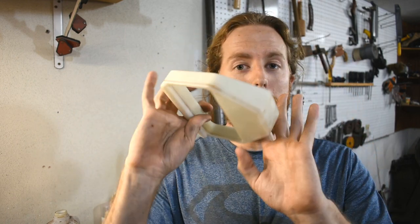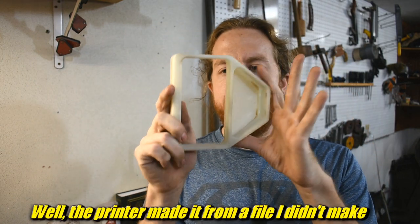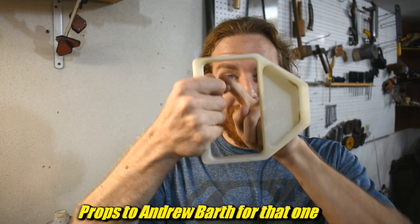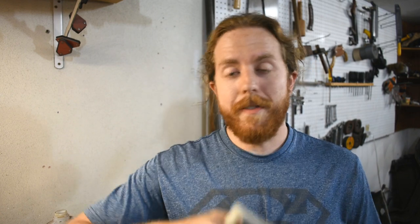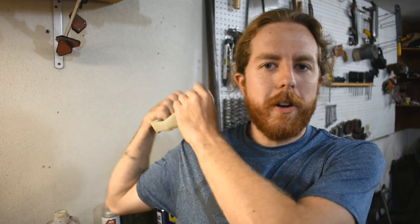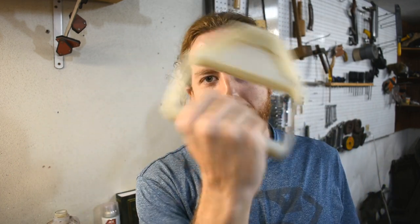I was nominated to do this part — the door handle. It's not like the latch; it's the thing you grab on the inside. This is a 3D print I made. It's basically a door handle — it bolts to the thing, you hold it here. It's kind of big for a door handle, but remember, you're wearing a space suit, which is freaking big, so you've got to have enough room to grip and pull the door open after you latch it.